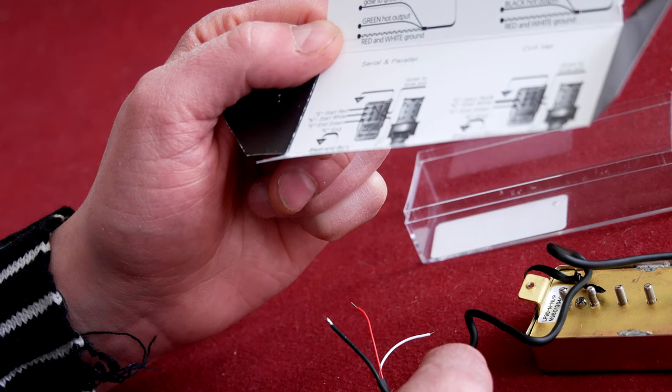So I put it in the wrong way. And if I use it with the original pickup, it goes out of phase and they cancel each other. But going forward, since I'm going to put another bridge version of the LP90 pickup in it, I have to connect it the same way I connected the neck version, so this is not a big deal. However, I would prefer to get some basic instructions that are matched to the model of the pickup, and not have to go online to check out the right wiring diagram.